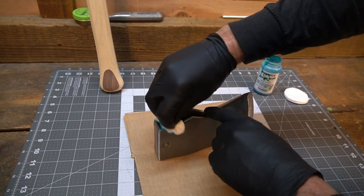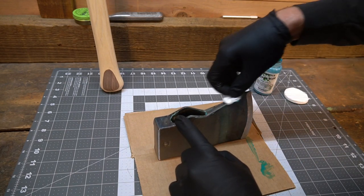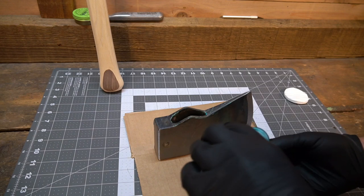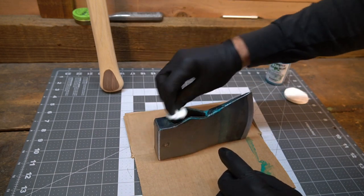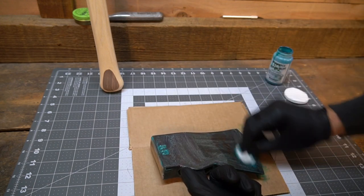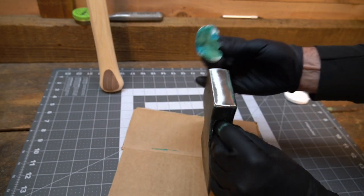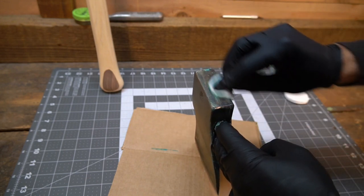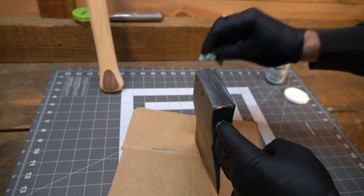Obviously when you're etching and bluing, you want to make sure that the steel is clean, free of any contaminants. And being that this is an axe, it's not really a big deal if there's splotches in the bluing or something. It's an axe. But I will say, clean it up. A lot of the time I'll just use Dawn dish soap. And then the number one thing to get a good dark bluing on here that I've noticed is warm steel, right? We want it to be warm.